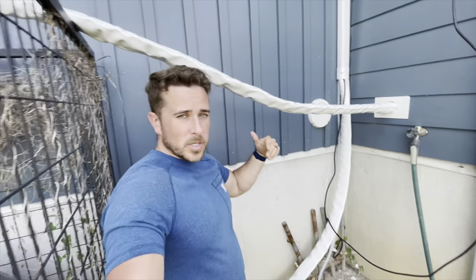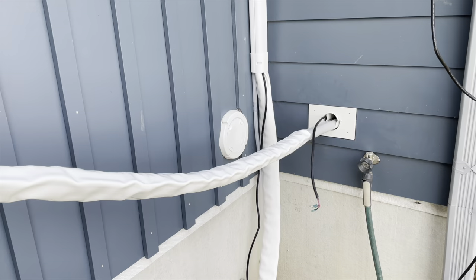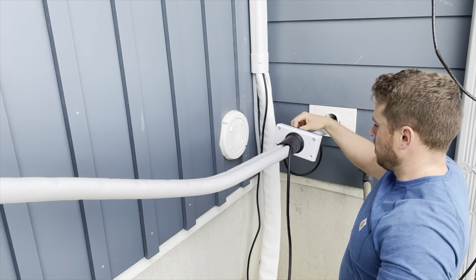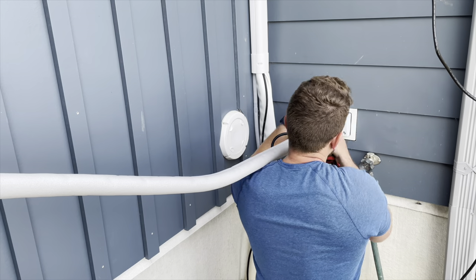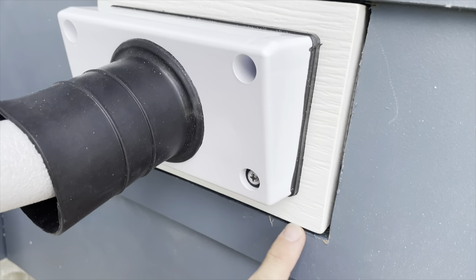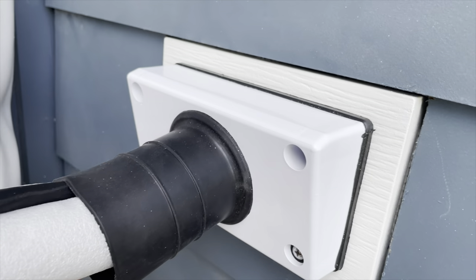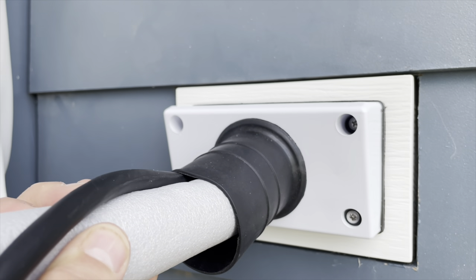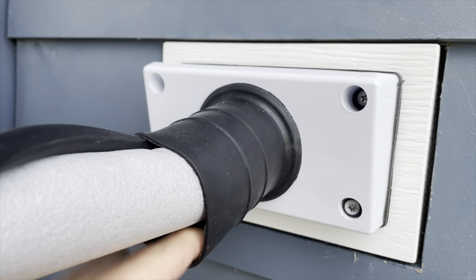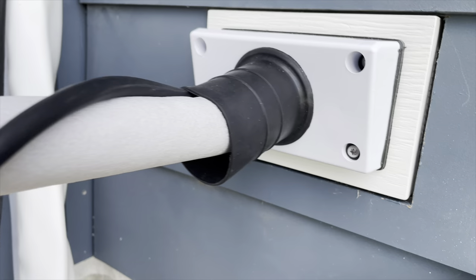Pulling this through by yourself is a pain in the butt. If you've got to pull through joists and anything like that, unless you're just coming straight out of the house, this is a two-person job. Now I'm going to caulk around all these seams here. This has its own little rubbery gasket material all the way around and it's on there nice and secure, so this should hopefully keep water out. These line sets come with clay to plug up the holes — what I'm going to do is use some of that clay right around where this pipe clamp is going to be and just squeeze that. That'll hopefully seal real nice all the way around the line set and the wire. And then obviously inside, I'm going to spray foam.